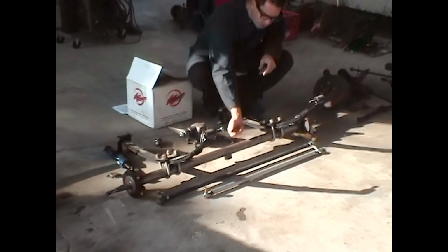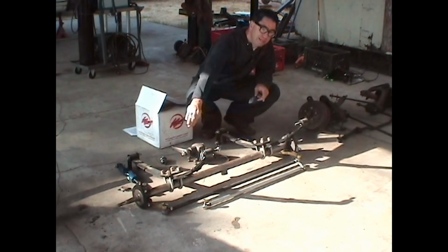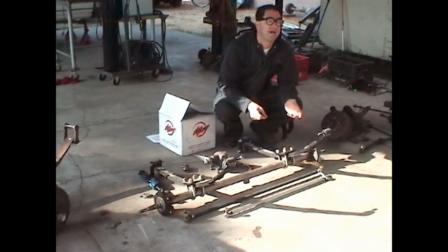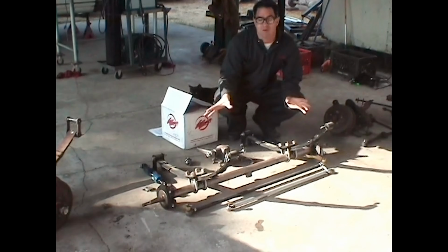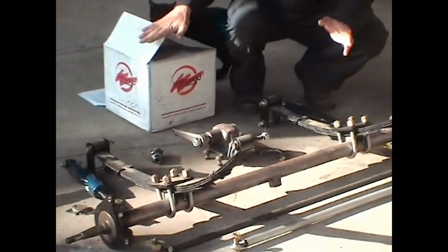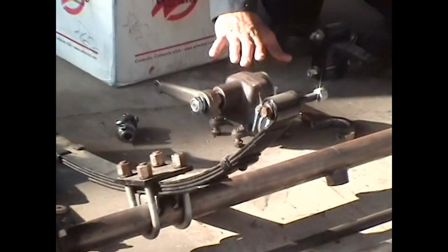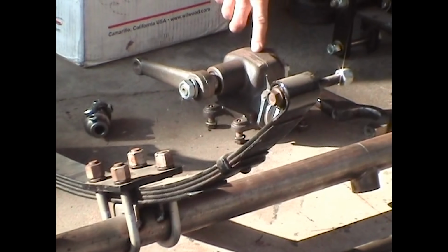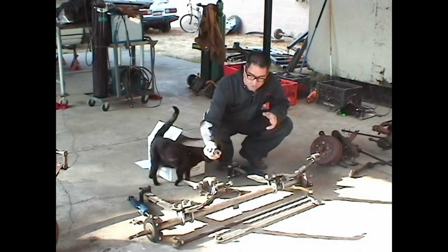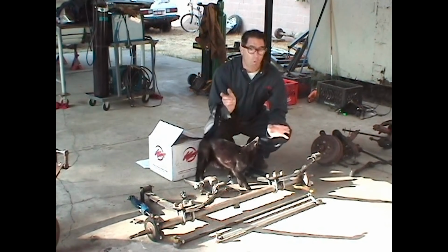It's heavy-duty wall, 2-inch main tubing with an internal stiffening beam that makes this rugged for street strip use in even a 3,500 pound car. The only downside is this stuff ain't cheap. Beyond the purchase price of the axle, you've got to buy Wilwood disc brakes, just about $600, a remanufactured or new Vega type steering box, these can be as much as $400, even things like this Borgeson joint, $69. So this stuff here can add up to almost $3,000,